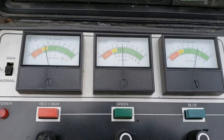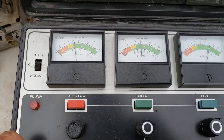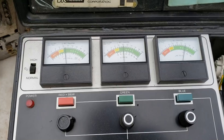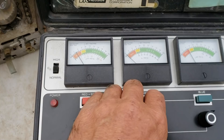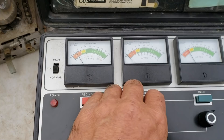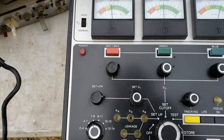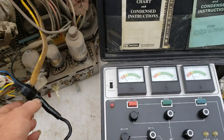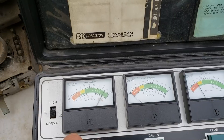These used a tripler, so the flyback has fewer windings on the secondary — pretty intelligent, because then you don't get the high-voltage potential causing the flyback to melt down. The triplers just fail like crazy. Let's put the CRT tester on it and have a look. It's so quiet out here I can hear the transformer humming. That's promising already — that's just cutoff. If I wiggle the socket I can get it to work. Now the cutoffs look really, really good.